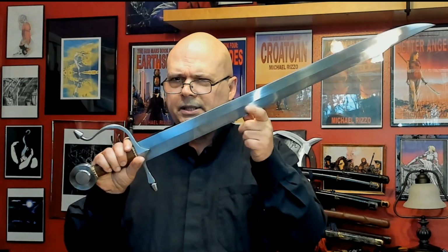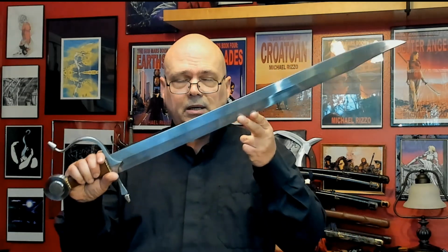You're getting a 1075 carbon steel blade that my test files are saying somewhere in the low 50s HRC, probably around 52, which is fine for a through-hardened mono steel sword blade. No problems there. Now your blade profile and length, I tend to say falchion, maybe Grossmesser. That's certainly not a Grossmesser grip. With some interesting design choices, starting with, yes, it has a diamond cross-section. And it's pretty well done, pretty crisp with a brush finish.